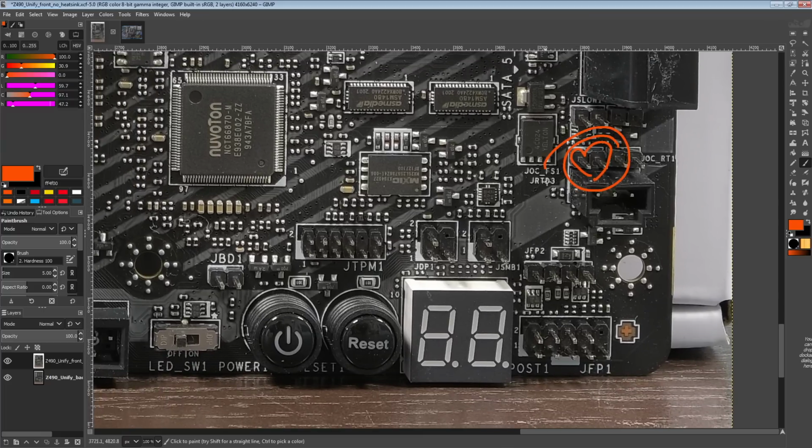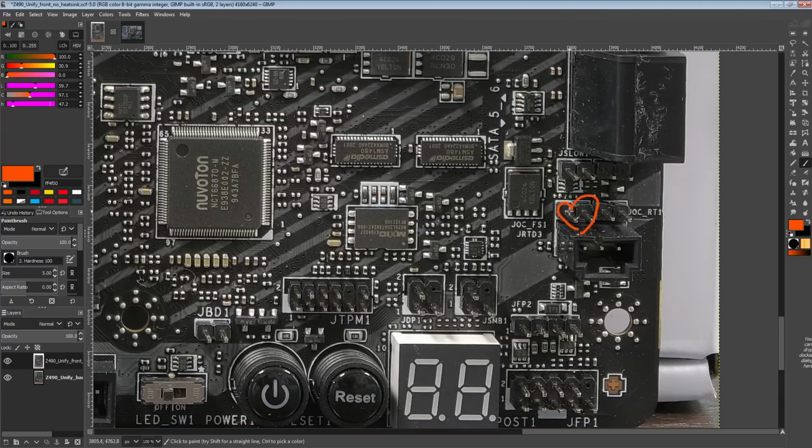So yeah, this is great if you're doing memory overclocking and you have no idea what you're doing, or even if you do. It just makes life so much easier if you make mistakes. So yeah, fail set like this. This is literally the main reason I hope the rest of the motherboard is good, is so that jumper right there. That's the main thing, because that jumper is freaking awesome.